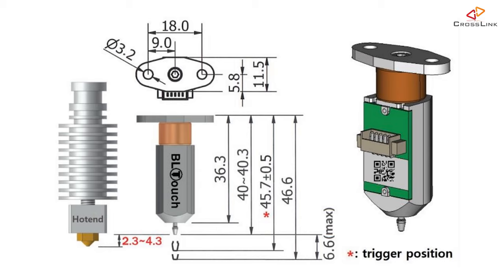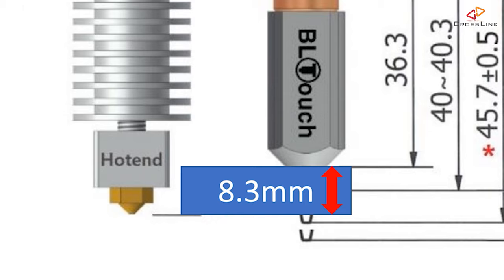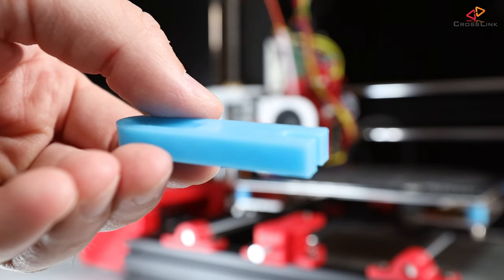The most important thing is that the BLtouch sensor needs to be mounted at a very specific height above the nozzle. Looking at the original instructions manual from ANTCLABS, the height difference between the nozzle tip and the BLtouch tip when it's retracted can be between 2.3 and 4.3mm. So if we add those 4.3mm to the 4mm that the tip will stand out from the housing, the BLtouch housing lower end should be 8.3mm away from the print bed. I tend to mount the BLtouch at the most upper level possible, because I ran into several issues with BLtouch probes being mounted too low and running into printed parts that stand up a little due to warping, which can crack the BLtouch needle.